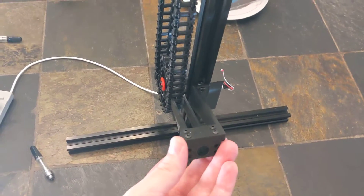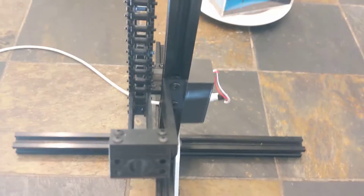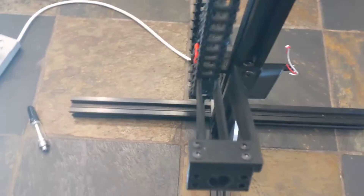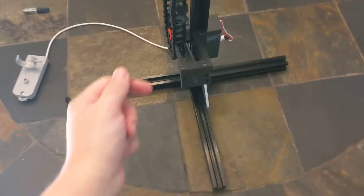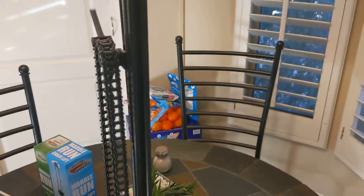Another issue is that the alignment is really sensitive. I had to play with these screws locking it into the 2020 aluminum extrusion to get this distance really precise, so that the cart lift scoops come up perfectly in between the slot without hitting — because if it nicks even a little bit, it loads up like a spring and shoots the cartridge out, which is obviously bad.